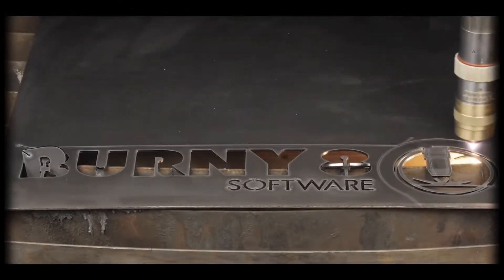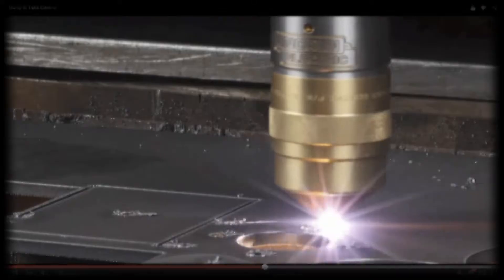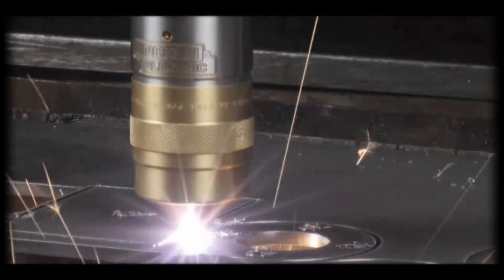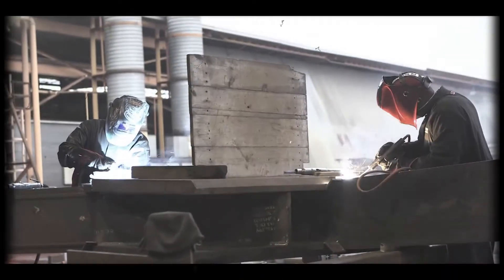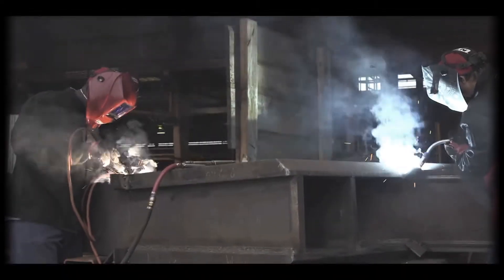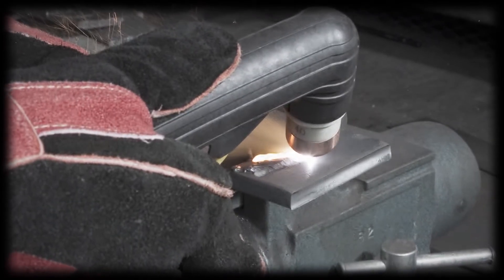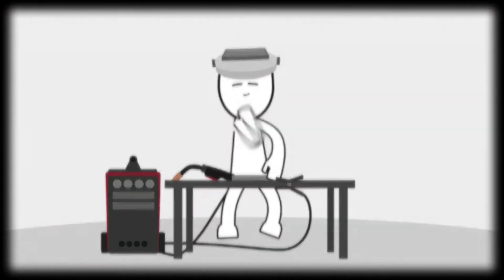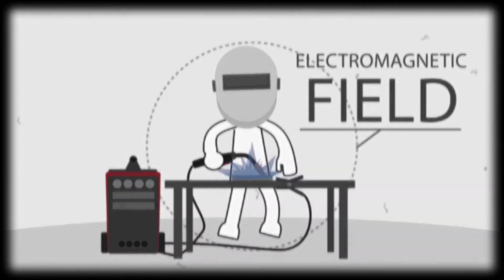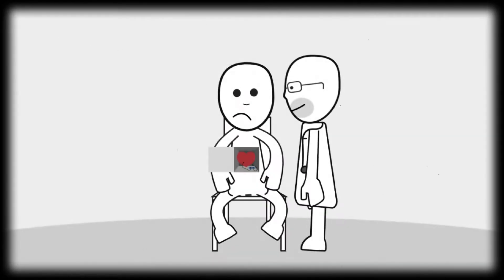There are lens shading guidelines you can reference at lincolnelectric.com, such as Z49.1. Because it's computer-controlled and very precise, CNC plasma cutting may seem contained and clean; however, metal cutting and marking operations can create a lot of dust and flying debris. Protect others in your work area from both UV and infrared light as well as flying debris by using booths, screens, or shields. Welding and plasma cutting also produce EMFs — keep the torch and work cables together as much as possible and away from your body.